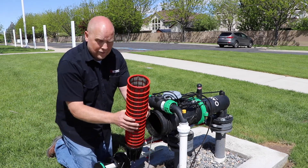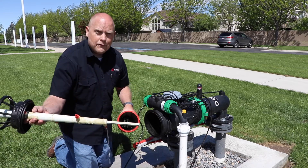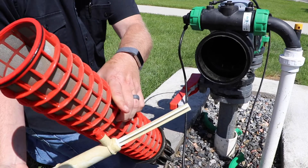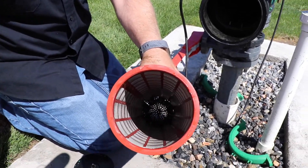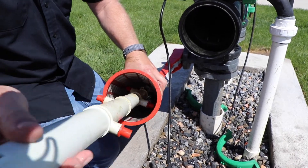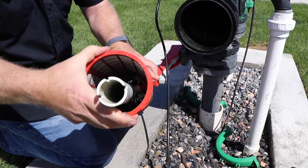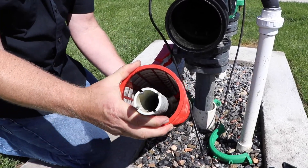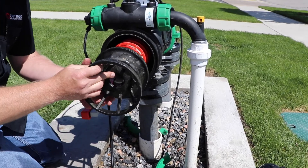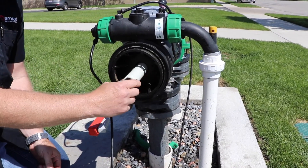When we take this one off, down in the bottom of the core screen there is a centering piece. That has to be centered with the scanner shaft here on the bottom. If those aren't meeting up, then it will not spin — it will just move up and down. When we assemble this back up, we want this portion to be centered in that bottom core screen. You know you've got it right when it will really move like this. It's wrong when you've got it like this and it won't spin. So make sure it's in the middle. It's best to do this when you've got the filter out like this — then slide it in. The beauty of the Mini Sigma filter is you don't have to have everything centered just perfectly. You can go ahead and just put the partition plate in, push it in, and it will center itself. We've got it in correctly because it does spin.